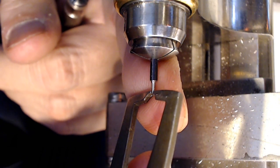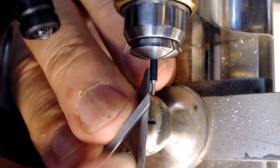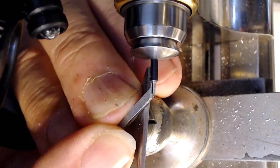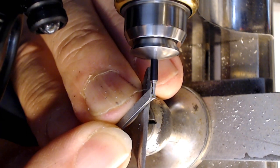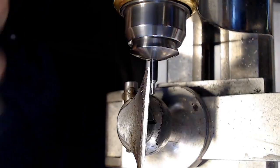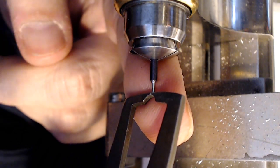It'll be sickening. Okay, that's at 9, so it's just below 9 right now. So 8 was the fit, so I'm just going to remove a little bit more material from the tip there. Just bear with me a second here while I chew the material down. Alright, that should fit the hairspring, and then I just end up having to take material away to move the hairspring up.